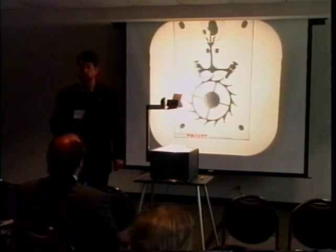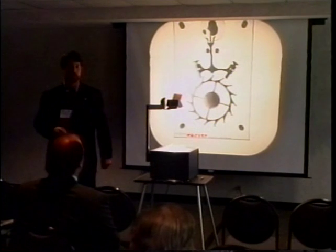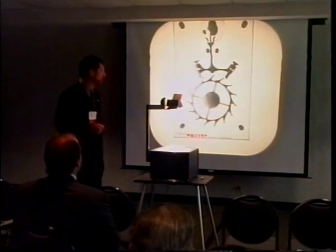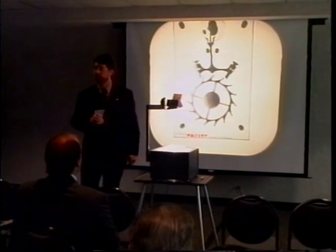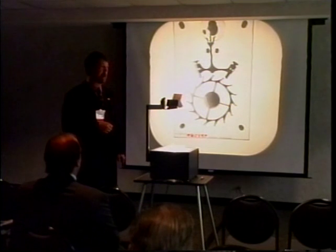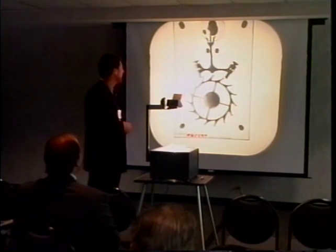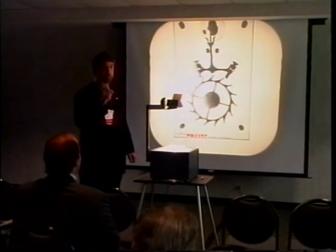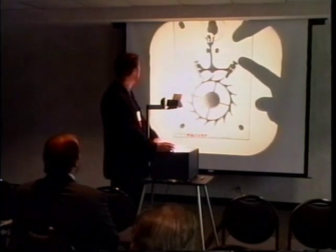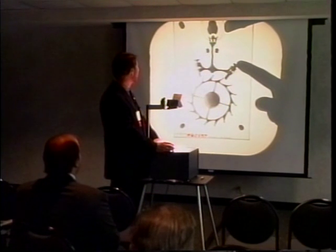Or heavy hand when someone restaffs it. They don't use the proper punch on an Incabloc staff. Or Incabloc rollers. Everybody know the difference between a regular double roller and an Incabloc? Got the little lips curved up on the bottom of it, and lots of times people will forget about that and they'll smash that and knock the roller out of round. Okay, so I think we're pretty good on the terminology here now.